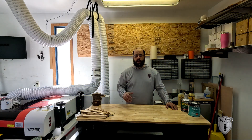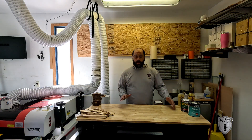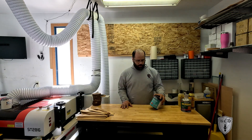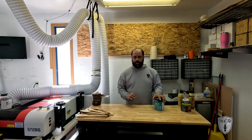The other product I want to show you is more for your wall art, picture frames, and exterior signs that need a protective coating. For interior products, polycrylic — which is a polymer-based product — is a fast-drying coating. You can put multiple layers on, and it's great for indoor applications. You want to sand in between each layer to develop a nice sheen, and it works especially well for contoured or angled products.